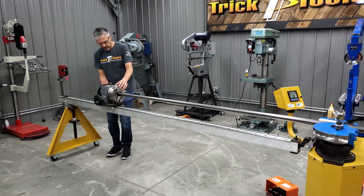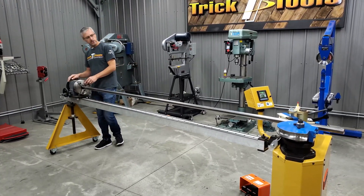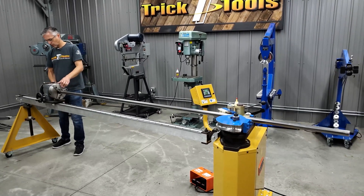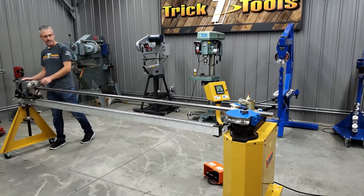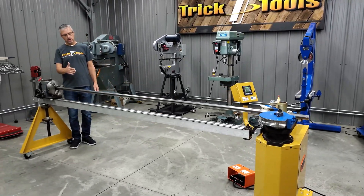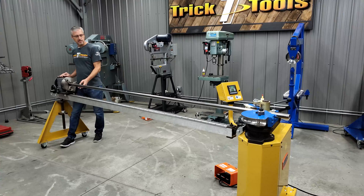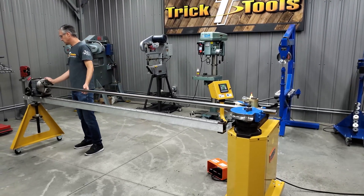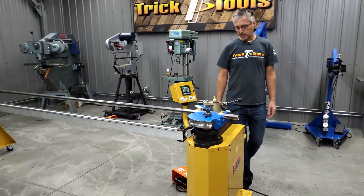Just lift up the lever. One of the things you want to do is pivot the table out of the way — that frees up the tube to slide through the die easily. If you're going forward or backward, you lift the lever to go back to the bump stop, and then when you're ready to bend you pivot the table back and it locks into the clamping arm on the die set. We try to run the table pretty much perpendicular to the way that the bender is set up. So if you're back against your length stop and your table is pushed up to 90 degrees to the bender, then you're ready to go ahead and make a bend.